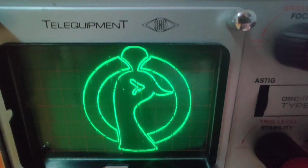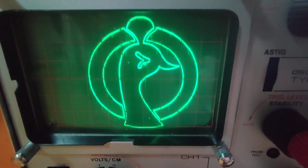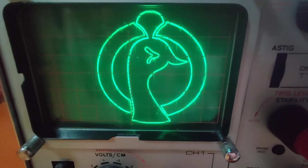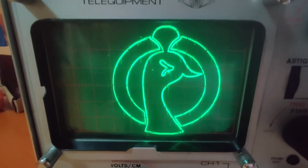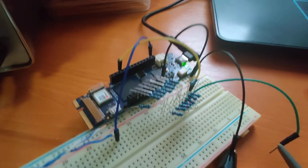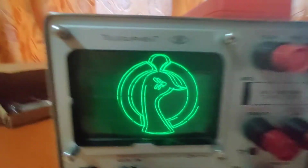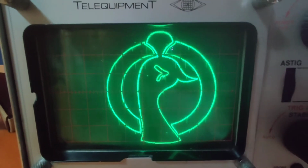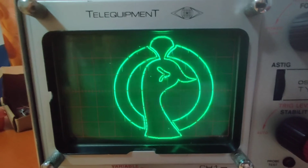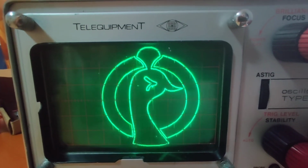These are called DAC glitches, and well, gray codes fix this, but there aren't any easily implementable gray code digital to analog converters, well, at least as simple as just a bunch of resistors connected like so. So we'll have to live with these DAC glitches. But yeah, here's another SVG. I'll also upload another one, which is the logo of another team.